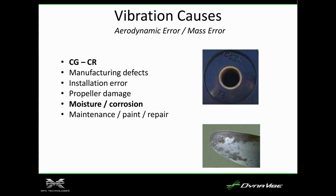In Wisconsin, I flew my Long Easy up there for about 3 weeks, left it in Wisconsin, and noticed a vibration the first flight after having it up there, and went and retorqued all the prop bolts, and they were about half of what they should have been. Had to get a torque wrench, retorque everything. The dry weather in Wisconsin had allowed the prop to shrink, and I didn't have proper compression, and so the prop was essentially back there chattering a little bit.